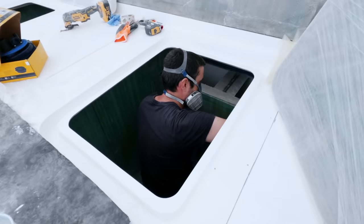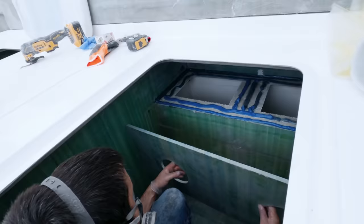Now that our flanges had fully cured, we could go back and put the lids in place. This process was more or less the same as earlier. Matt would still use our thickened polyester resin to coat the flanges, and once they were fully covered, the lid would be placed on top. It would be firmly pressed into place and later glassed from the outside.